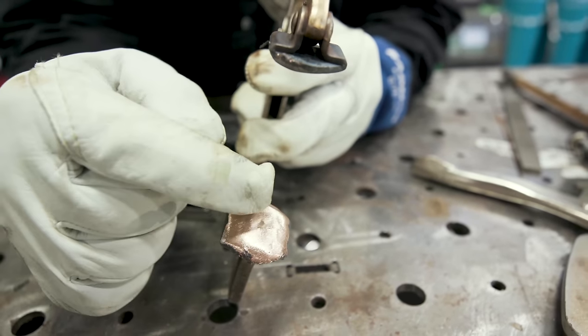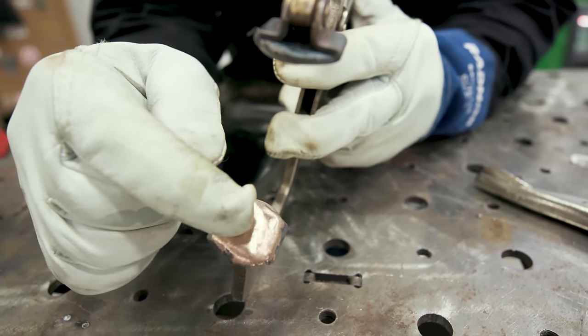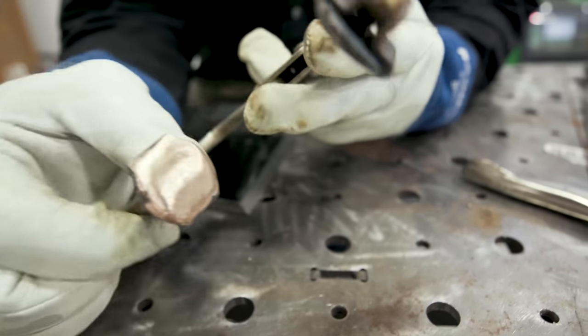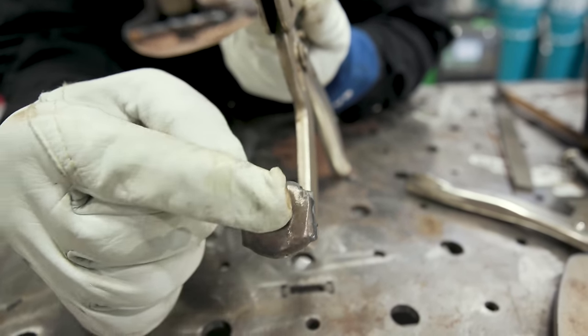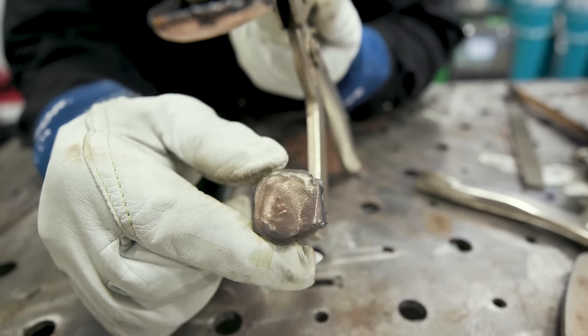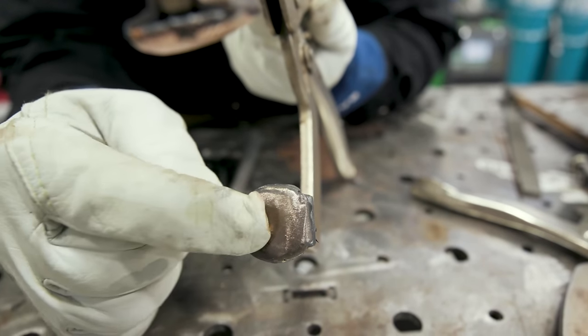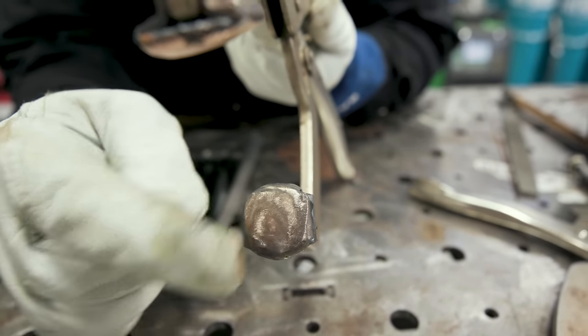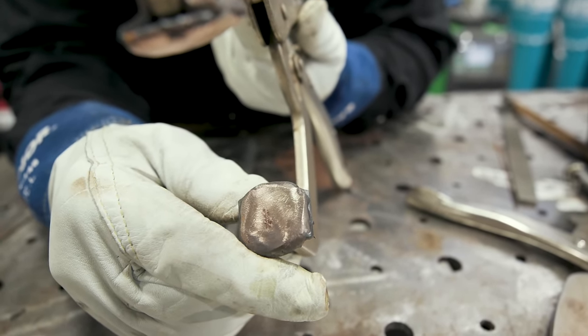You can just put your material together, clamp it, and not scratch it up. You can actually see where we clamped it — I marred the surface of the foot instead of the material. You don't have to clean it up if you don't want to — I just did that so you can see it's actually silicon bronze. It's softer, and that's where it's transferring the pressure and the scratches to, versus the stainless steel or aluminum finish you're working with.